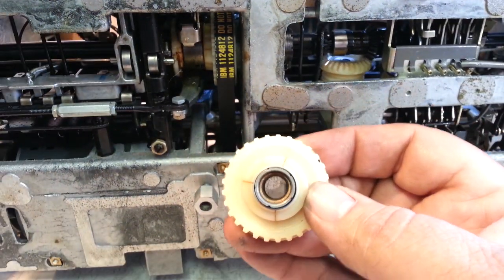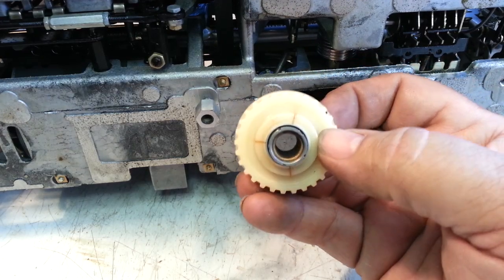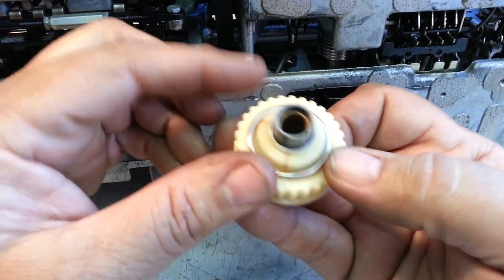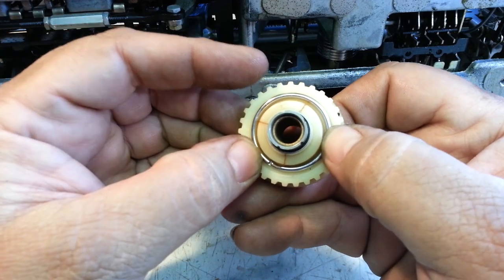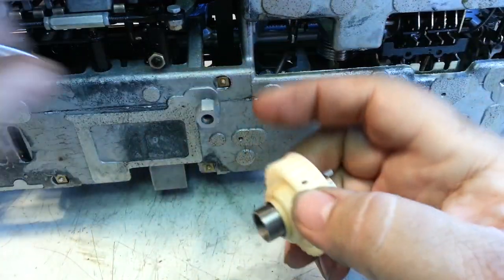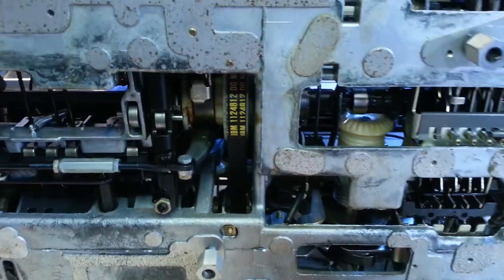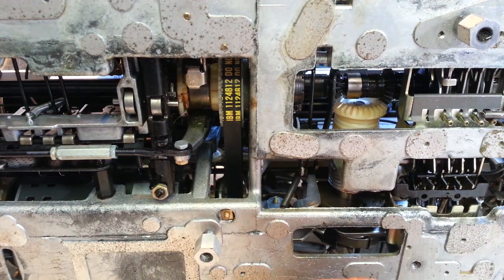Before they crack to the edge, two things can be done. You can put in a metal ring, melt it in there, and that's really a good repair — preventive, probably going to stop it from cracking. But you have to take the machine apart to do that, to get that ring in there. So there is a preventive way that's been around for a while.